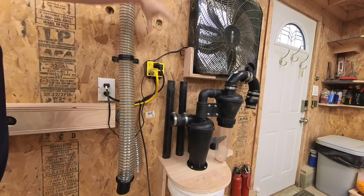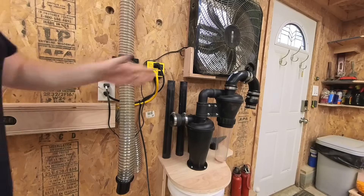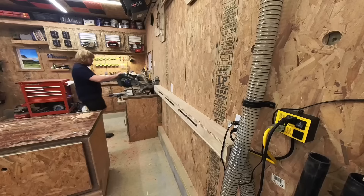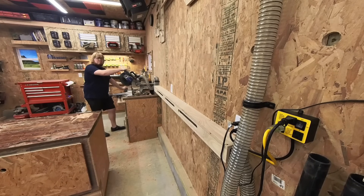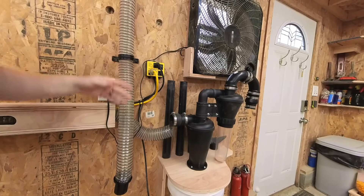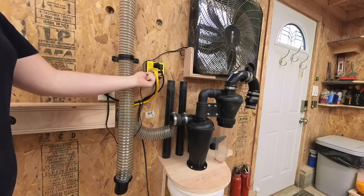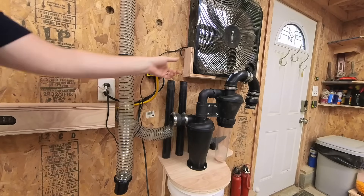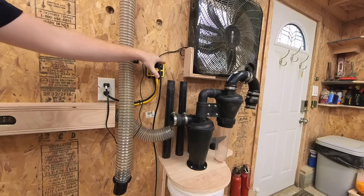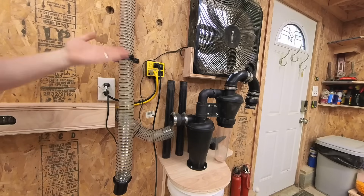Here's a vacuum control switch I want to mention. I have my miter saw plugged into it and you plug your vacuum into it as well. Once you kick on your miter saw, it tells your vacuum to turn on. It's a delayed system by about two to three seconds, so you're not blowing fuses or overloading circuits. It works the same way if you plug in an extension cord or run the table saw — it feels the power and turns on the vacuum as long as the hoses are hooked up correctly. I'll put a link to this in the description. Make sure you're using a heavy-duty cord because you don't want any power dips going to your saw — it's not good on the motors.